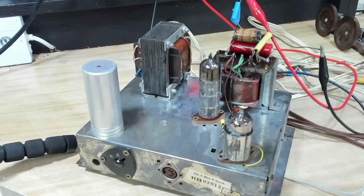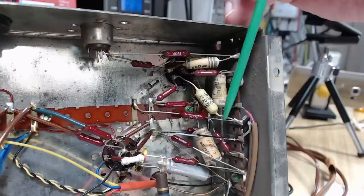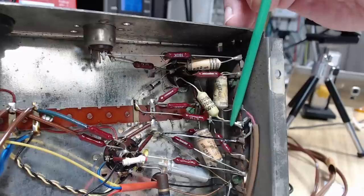That capacitor's hot - very, very hot. What I'll do is let this cool off and run it again in about 10 minutes to see if it gets hot again, and maybe it'll work. I'd totally forgotten that component was hanging off loose like that - I think it goes there.